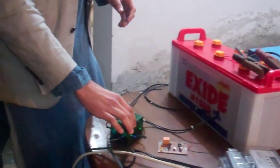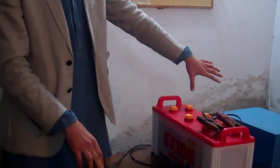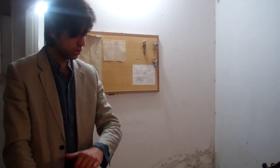Another independent component is this relay. The purpose of this is: if you have the main grid coming in and the UPS is running as usual, and if you have enough solar energy, it's going to switch the main grid off so that the battery can be charged from solar power — saving you on electricity at that point. If sunlight is not enough, it switches the grid back on, and depending on the status of your UPS, it determines how to charge or not charge the battery.